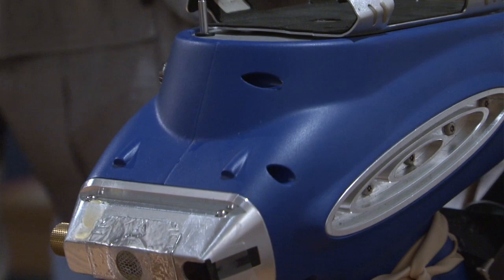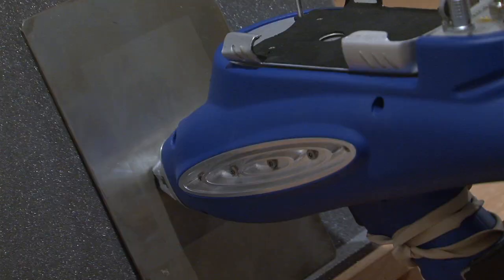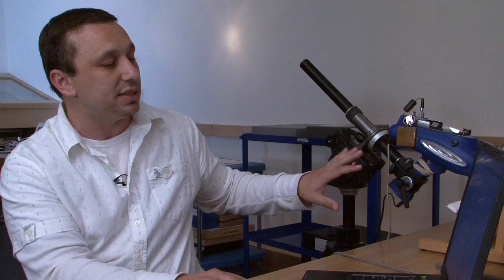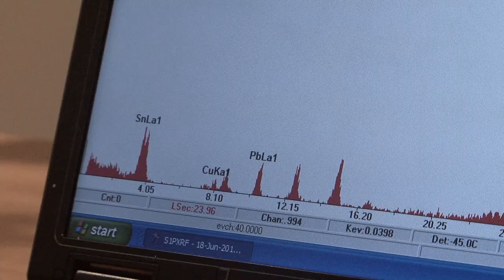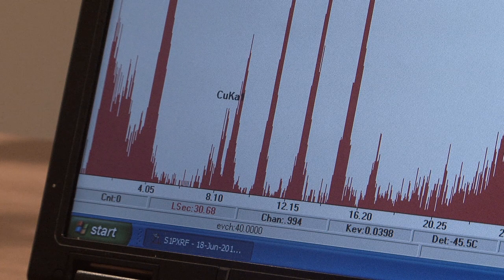What we have here is an X-ray fluorescence spectrometer. The beauty of this instrument is that the analysis is non-destructive, meaning we don't have to sample the material and none of it gets destroyed. It's also non-contact, meaning we never have to come in contact with the material. The instrument emits a beam of X-rays which excite the material in the sample; when that material de-excites, it releases radiation sorted by energy, allowing us to identify elements present. On screen is a spectrum of the Christ Bearing the Cross plate — peaks are identified, and the relative heights indicate relative amounts of each element.